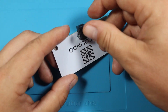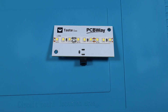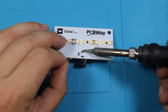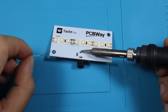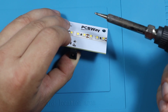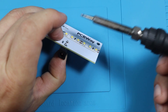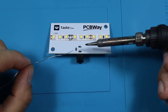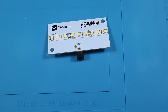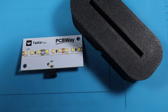For the connector, it's important to keep it oriented from the other side — we add it from the bottom and solder on the top, or vice versa depending on how you look at the board. Let's add a bit of solder, push it to verify it lies flat, and that looks okay. We can now add solder to the rest of the pins. That looks okay and soldered nicely.